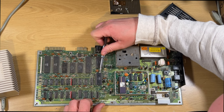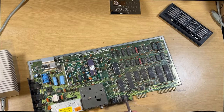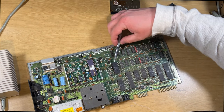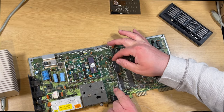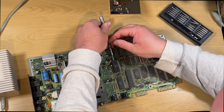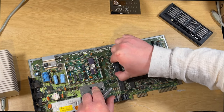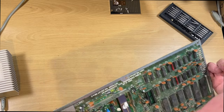I don't believe it is the memory that's causing the issue, but ultimately if I want this as my main running Commodore 64, I'm not leaving it like that - it's just ready to go, there could be dry joints, joints not even attached. It looks horrendous. For now I'm just removing these chips so they don't get any unnecessary heat. As you can see, this is a 1983 revision board - some of them come fully socketed, this one doesn't; certain chips have been socketed, certain chips haven't.